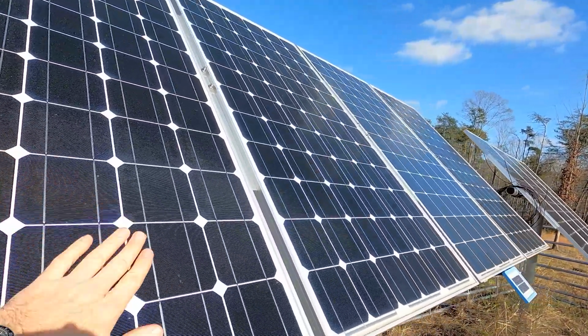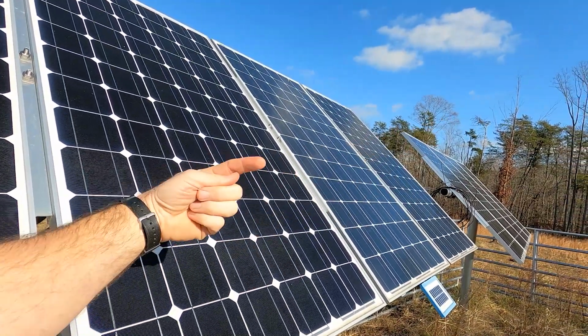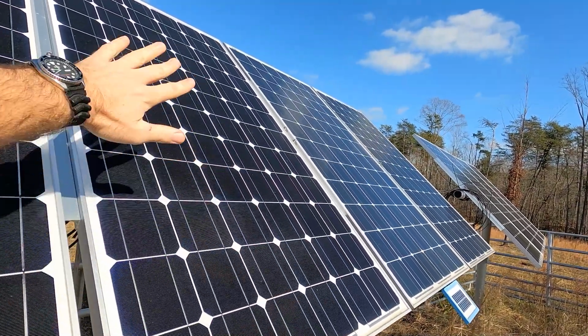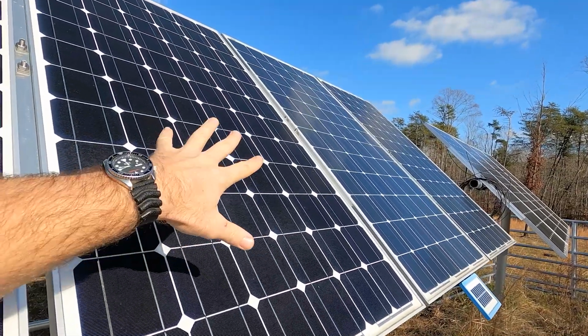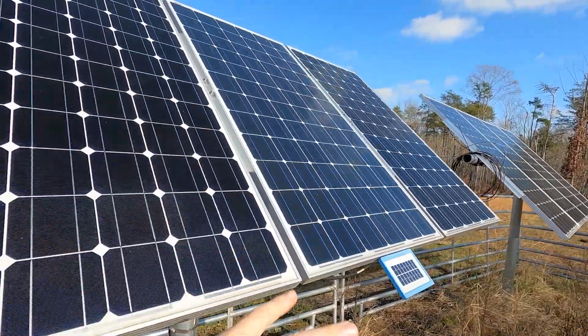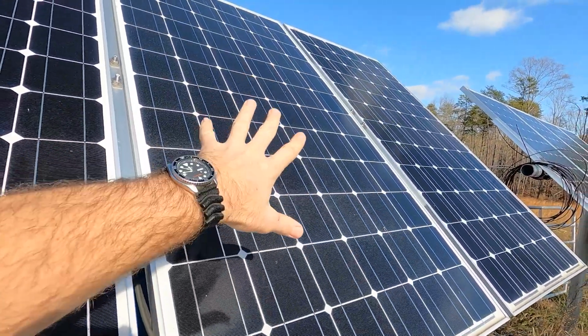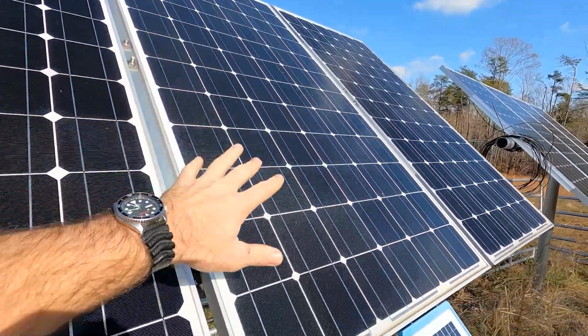So all these solar panels are nice and warm. They are set in this direction, they are pointed south. They are also angled appropriately to get maximum sunlight throughout the year, and so that snow and ice will shear off of this and will not cause us a problem in the future with weight and or pulling over this and or blocking the sun out.